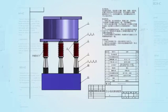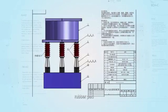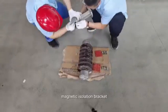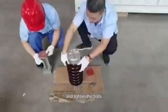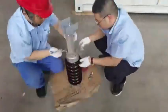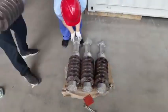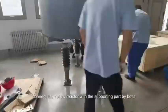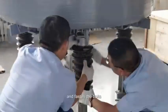Installation of outdoor reactor. The outdoor reactor part is composed of pad iron, magnetic isolation bracket, rubber pad, pillar insulator and reactor body. Connect the pad iron, magnetic isolation bracket, rubber pad and pillar insulator by bolts in sequence and tighten the bolts. Lift up the hollow reactor and connect it to the supporting part by bolts. Add a rubber pad between the reactor and the supporting part and fasten the bolts.